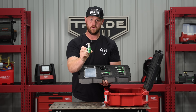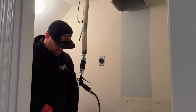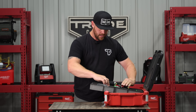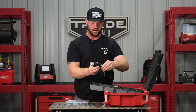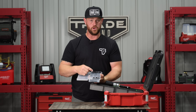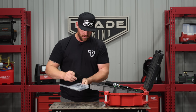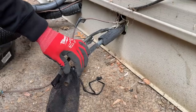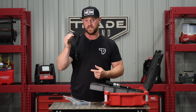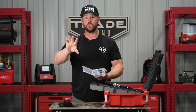For instance, this is a three-quarter. The hose side will go on to your tubing — you hand tighten it and this threads into your gun. With this gun you connect your nitrogen tank, then you open it up here. It has this open slot and you put one of these foam plugs in there. You want to use the size you're going to be cleaning — so if it's three-quarter, you grab the three-quarter plug. Then all you have to do is put this little net bag on the outside, so when you blow that plug through from the inside out, this little bag is going to catch it.